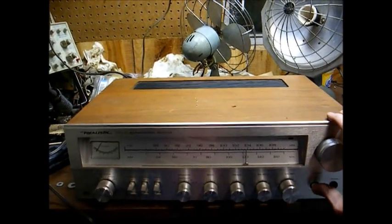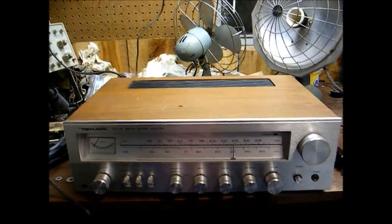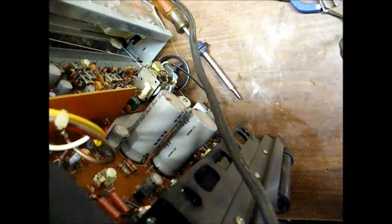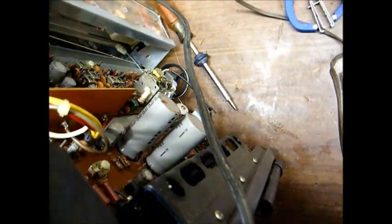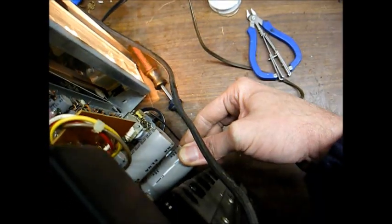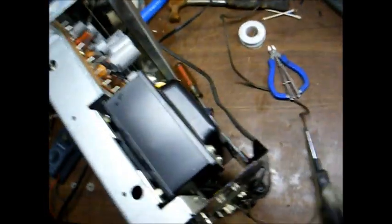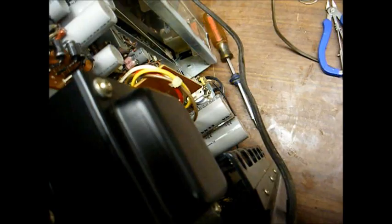So let's see what we can make it do. It's not cooperating now, but that's the symptom we have, so let's open it up and see if we can determine what's wrong with it. Here's the culprit right here — this electrolytic filter capacitor. When I move it, the hum goes away. So that's either a bad solder connection or an intermittent connection inside the capacitor. Let's try re-soldering it first.